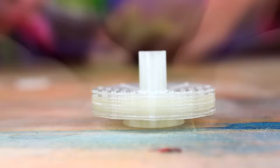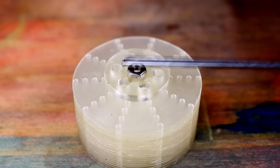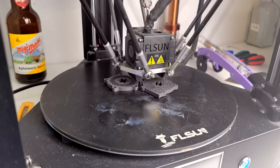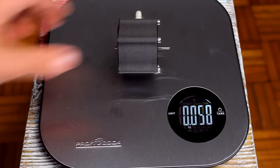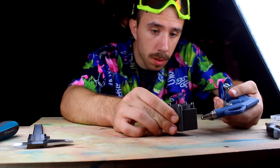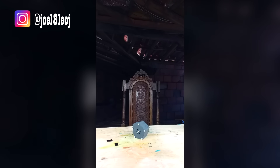After inserting the discs on the 3D printed shaft, I cut a piece of M3 threaded rod to serve as the axis. I glued two M3 nuts in place — and just like that I had a rotor for the turbine. Next I 3D printed the casing and the lid using the foamy light filament from ColorFab so the turbine would be as light as possible. This casing has a really thin inlet because we want to turn pressure into speed. After assembling the turbine I tested it using my lungs, because it's a tradition here on the channel.